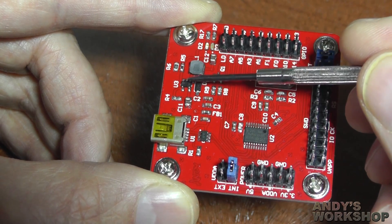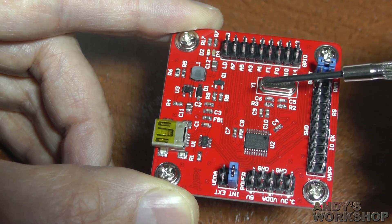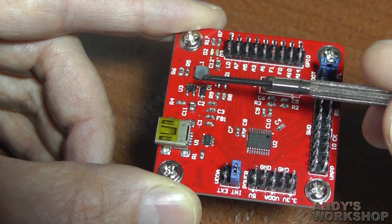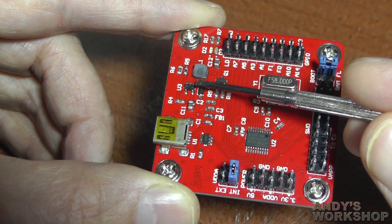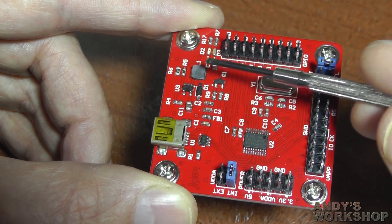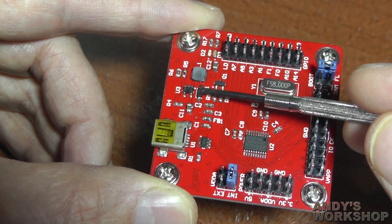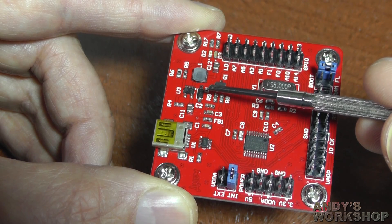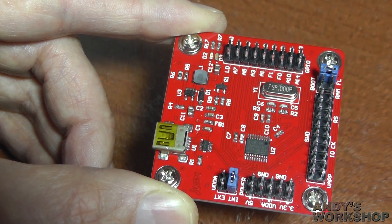The regulator on here is a Texas Instruments step-down buck regulator that drops five volts down to 3.3 volts at an extremely high efficiency — 90-plus percent — so you can get close to the 1.5A output and the heat dissipated would be hardly any. It's far more efficient than a low-dropout regulator. This is an adjustable device, so there are a couple of external parts: set resistors, an inductor, and a catch Schottky diode. With my choice of components, the limiting factor is actually the diode, which can only handle 500mA of forward current maximum, so do check my website for notes on which parts need to be rated for higher current before using the regulator at its maximum.